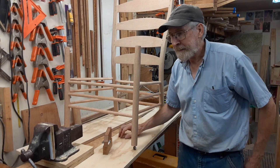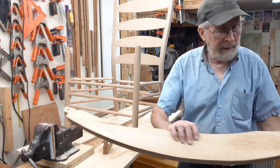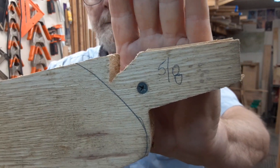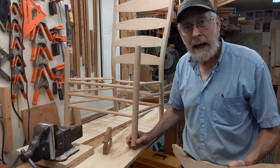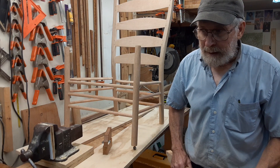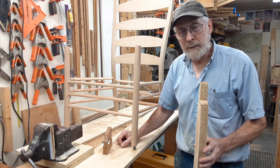I'm going to show you some things about the rockers. One thing I may have failed to say all along is how thick the rockers are — they're five-eighths of an inch, and that's just approximate, doesn't have to be exact but close to that. These legs are only an inch and a half, and they're probably a little light on that, so we can't be putting one-inch rockers on, or even three-quarters — that would probably be too big.